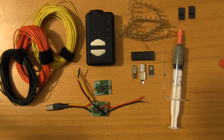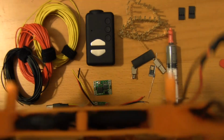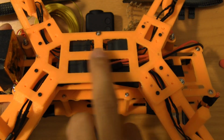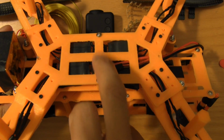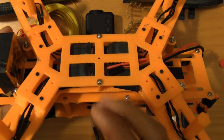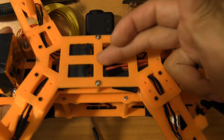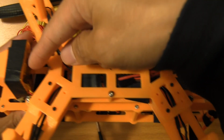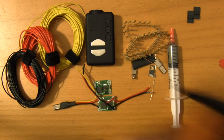And if I could give you an example of what that would look like, again, this is that 3D printed quadcopter. Hang on a second, I'm going to show you the bottom side of this. Under here, there's the 4 ESCs and then a single copper PCB strip that I use for my power distribution. It's actually got two sides, positive and negative, and all you do is run a tap from there directly to the front of the rig, and that's where you'll be connecting the Mobius power rails.